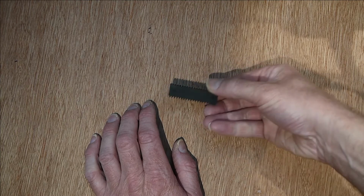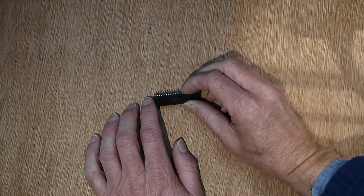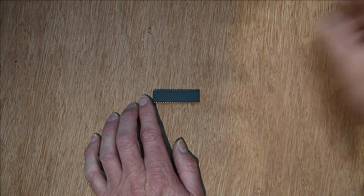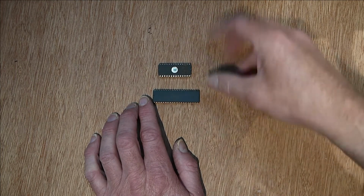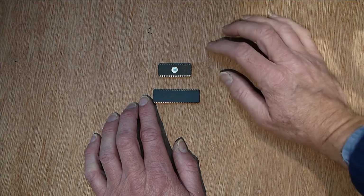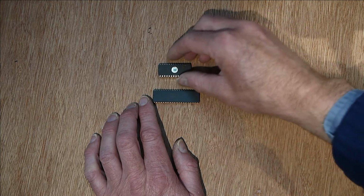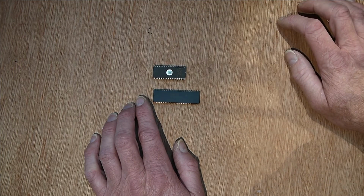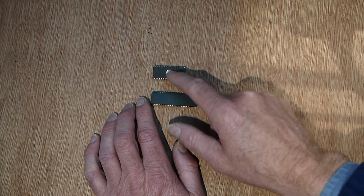So if you wanted to have a microcontroller, or the equivalent of, back when this came out, you'd put this in a circuit with some RAM and an EEPROM. That's an EEPROM, and that will give you, with some latches for I/O, a sort of microcontroller equivalent. Now I've always wanted to make a Z80 sort of small computer, but one of the things that's always stopped me is this.